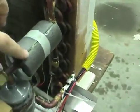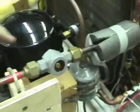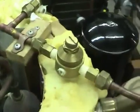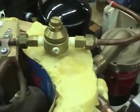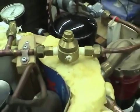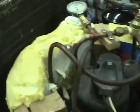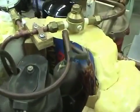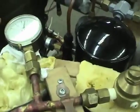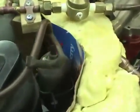The TXV bulb is under this insulator. There's another sight glass on the suction side. There's a pressure regulator to prevent the compressor suction from getting too high pressure when the outside ambient air is very hot — say if it was 35 degrees outside, the suction pressure would be way too high for the compressor and it would be overloaded. I've got a pressure gauge so you can see what's going on on the low side, and then the suction goes back to the compressor.